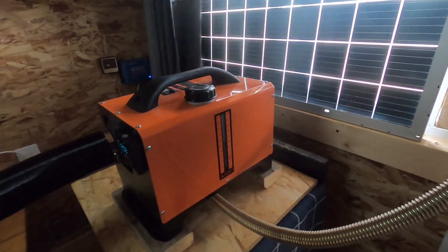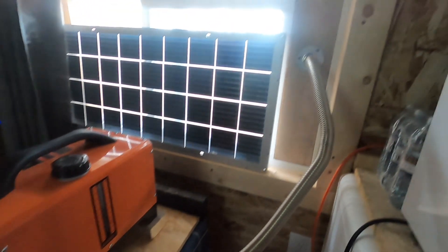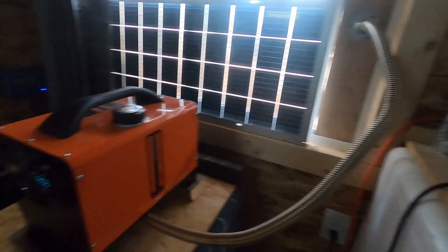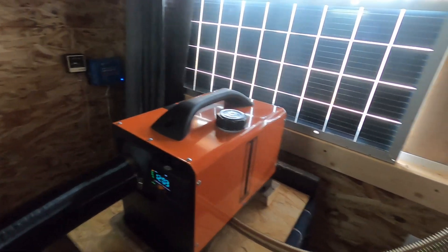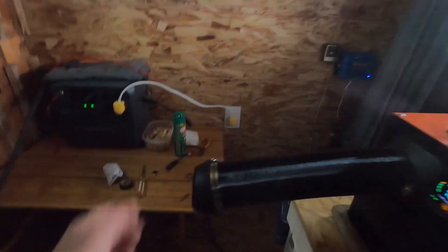The tank should last a good 10 hours on five liters, not running at full blast. It's supposed to be about 20 to 30 percent cheaper than propane, so it's just another way of heating. This is all temporary — just for the winter as additional heat. The way I like to use it is in the morning when the fire has burnt out, just kick on the diesel heater to get things warming up while you get another wood fire going. Wood is still the main source — 90 to 95 percent. I want three ways of heating in case one goes out.